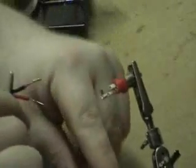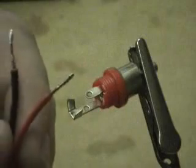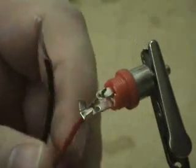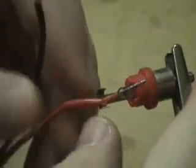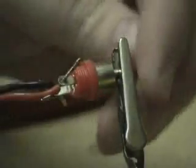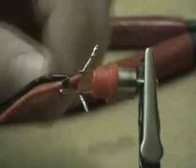The next step is where we're going to try and get the red wire through the little hole here. The wire is going to come from either side at this point — it doesn't really matter. Come up through the hole and sit it over there so we have a nice, straight connection. What you want to end up with is both pieces of insulated wire sitting nestled in that little metal clasp. One going up, one going down. As we turn that around to its side, you can see we have one wire coming up through the center pin, and the black wire going down through the earth pin.